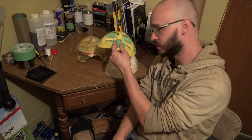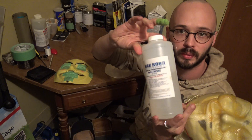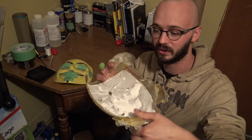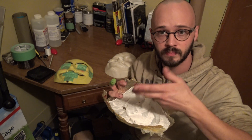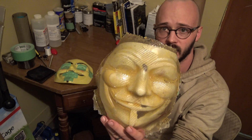I took this mold and the mask and formed fiberglass in between them. I used high-impact resin — the para-aramid epoxy max bond resin from my energy-absorbing hat build — and simple fiberglass plain weave so it would conform to the shape better. Ballistic-grade fabric is very tightly woven and can't be manipulated around shapes easily. With three layers of fiberglass as my template, I plan to build inward with about 10 to 12 layers of Spectra fabric, then add a viscoelastic polymer backing for comfort, plus elastic for head contouring.